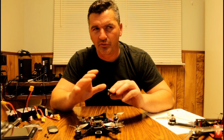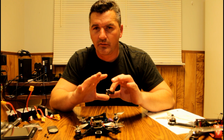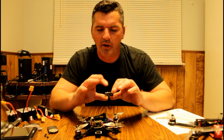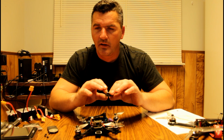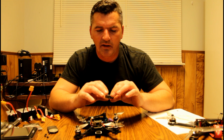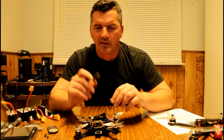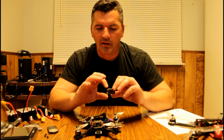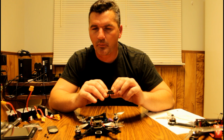Now with mine, I normally fly, because I'm out in the country and I don't have a lot of interference. So I normally fly my quads around here, around the house, at about 200 milliwatts. I found that puts out plenty of power for me, 200 milliwatts, and even when I go into the city, I might bump it up to 500 milliwatts, but a full watt of power, I don't see ever needing that, but as soon as I say that, I probably will.